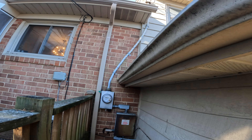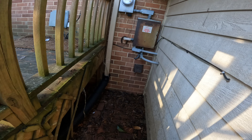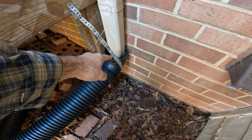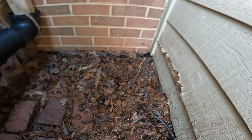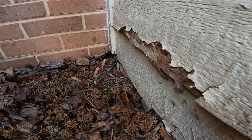Look at where the water has overflowed here from the gutters. We've got a corrugated pipe here and I just messed with this — it's full of ice. My guess would be that water overflowed here from the gutters, and once water lands right here it has no way to get out, so it's going to go down. A couple other indications that there's been water here — look at the rot right there.